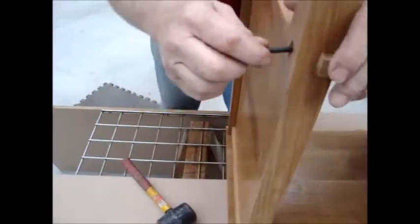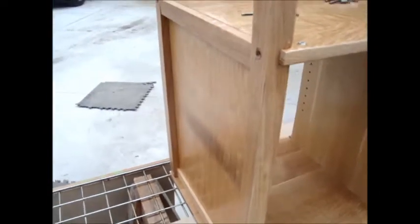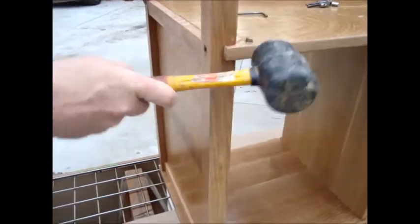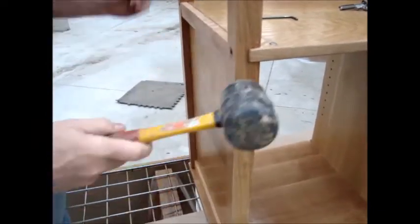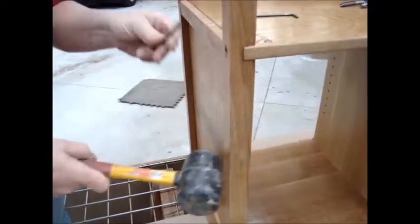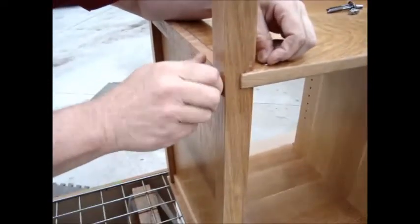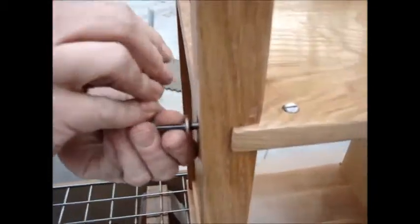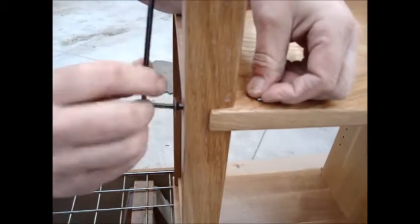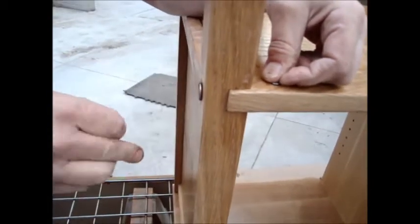And the trick here now is you're going to have to make sure that that screw goes in there. And you see it's not going in, which means that that front panel is forward a bit. So we need to kind of knock it back. And see again, if you were to try that with a hammer, you would really dent this thing really badly. Okay. And it'll come to a point where it'll just slide in, and that's it. And then you turn it, and you'll feel the barrel nut will connect. It should just very easily connect. It's very, very light. See, I can finger turn it once I've started it.